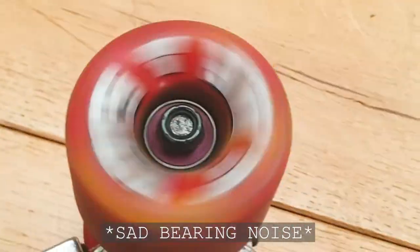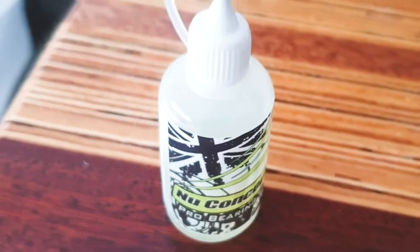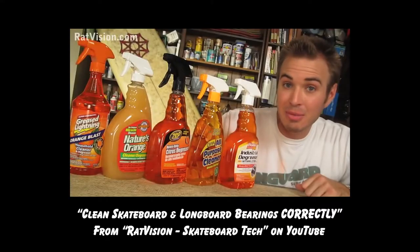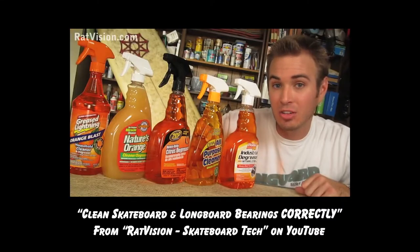The aim is to make them work better than this. I bought some thin oil off the internet, off eBay. Only cost about a fiver. It's a thin oil, so it should work better than speed cream and that sort of thing. I watched a really good guide on YouTube, so actually most of this advice is going to be his. I'll pop a little clip on that. What I highly recommend using is citrus cleaner — citrus cleaners contain orange oil, and orange oil is an organic compound called terpene.